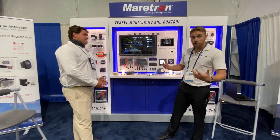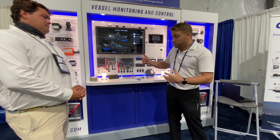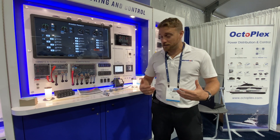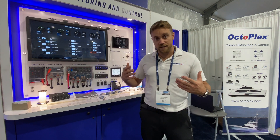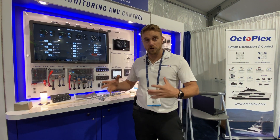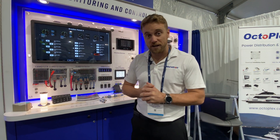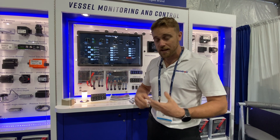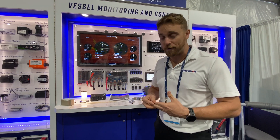What we've got here is our new digital switching. What we're introducing here at the booth is the CLMD-12 and 16. They allow you to take your standard NMEA 2000 PGNs and control all of your digital breakers. What we have here is our 12-channel module. The CLMD-12 allows you to do up to 75 amps worth of distribution, giving you a collaboration between 5, 10, and 12 amp channels. You can even bridge some if you need a little bit more power.